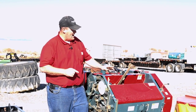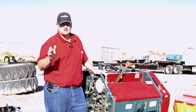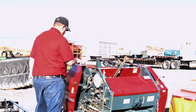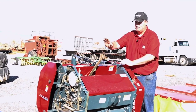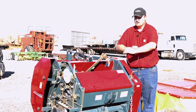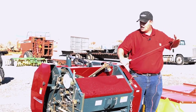I'm going to show you a couple of things: first, how to thread the string through the baler and get it set up correctly; second, what needs to happen with the tie arm — especially if you stored it over the winter and came back not knowing where the arm was. Since I already have the string in here, I'll show you what the tie arm does and where it's supposed to be. This string is what actually powers the tie arm — once it goes into the baler chamber and the hay grabs it, that's what moves the arm.